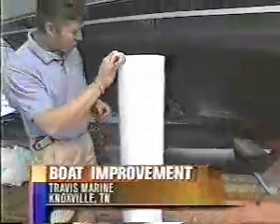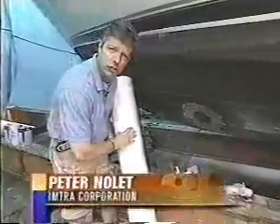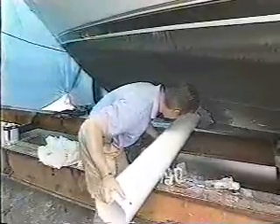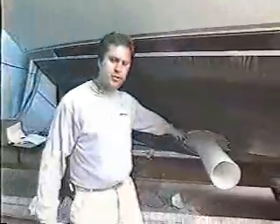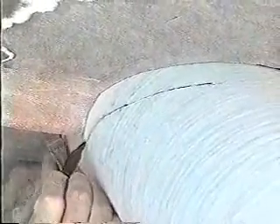It will allow us to do the glass work. Now we're just going to do a trial fit on the tunnel, make sure we've got a nice, tight but smooth fit. We put the tube through the boat. We're going to make our marks for where we make the flare from 12 o'clock to 6 o'clock, here in the forward part of the boat. And that's how the water is deflected around it so it doesn't run in the tunnel.